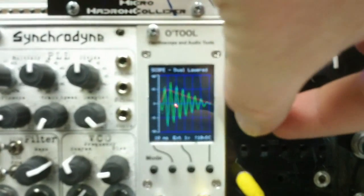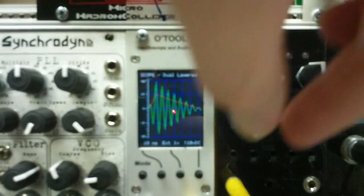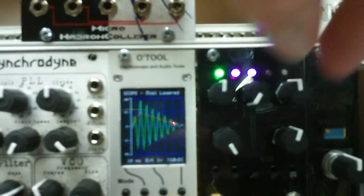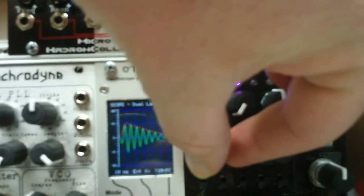So here at 5 volts, which is a pretty low power envelope, if you want more level, adjust the bipolar VCA control and it will give you out to 10 volts from 5 volts — so a gain of 2.